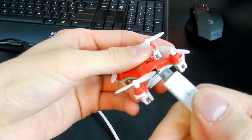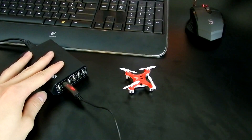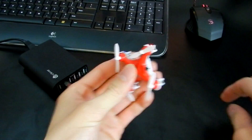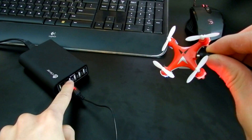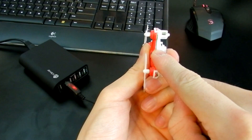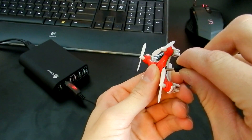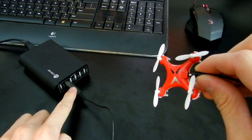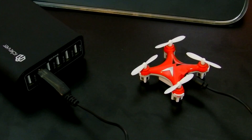If you're wondering if a micro USB cable is used to charge the drone, it is not. It has this weird charger input — make sure you don't lose it because you're not going to be able to find it or buy it; you'll have to buy a new drone for that. When you plug it into the USB wall adapter, it lights up red, which means it is not charging anything, and you will still get that light when you plug it into the drone while the drone is on. Make sure you turn the drone off and then plug in the charger. You will see that the charger does not light up, and it will eventually light up after 10 to 15 minutes when the drone is fully charged.